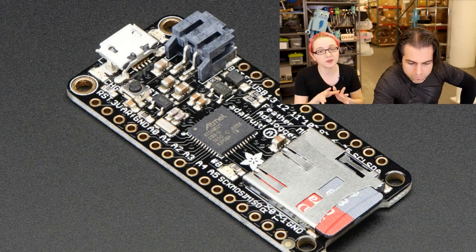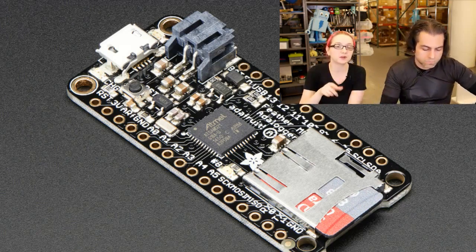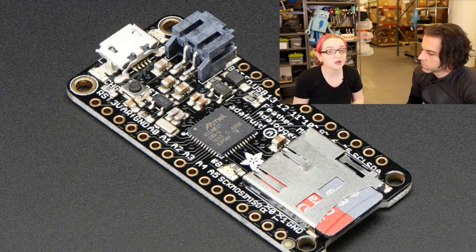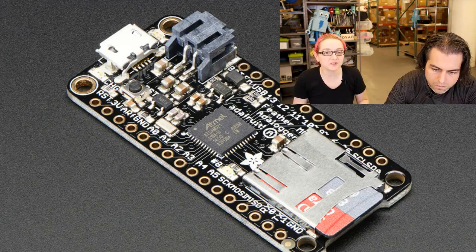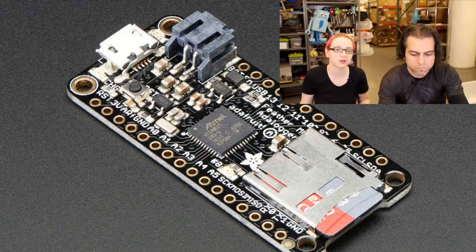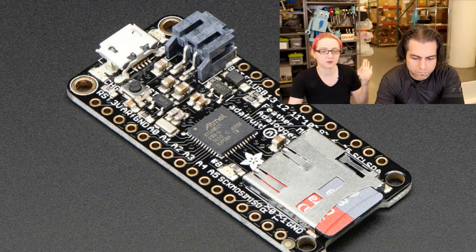This version removes the prototyping area and instead gives you a microSD card. The microSD card is connected to pins not exposed on the breakout, so you get SD card reading and writing — very handy for data logging, which is why it's called the Adalogger. You can also read a WAV file off it and play it through the DAC on this chip. It's a very powerful chip — you get a ton of flash and 32K of RAM, so you can really use the SD library without worrying about running out of memory. The SD card library uses about 1K, so you're totally golden.